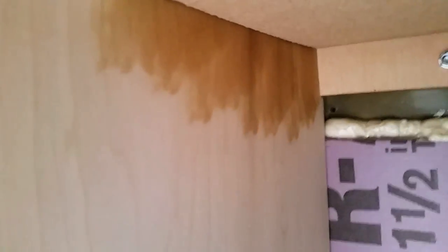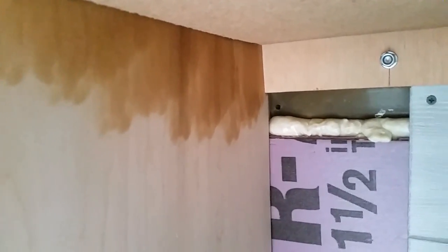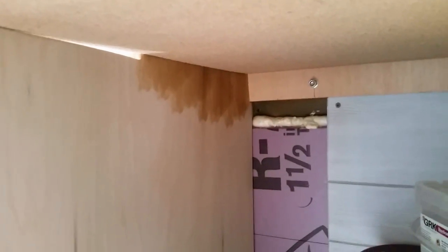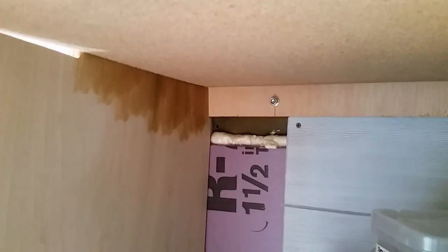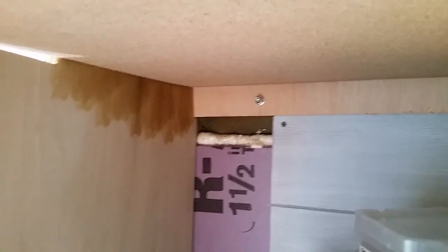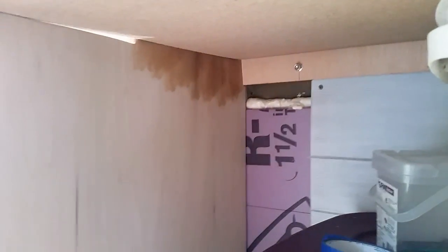What was so fiddly is that I have to have a board underneath that is bolted to the L-track. When I put everything together, that board will be bolted into the back of this cabinet wall on both sides, and that's what will hold the whole cabinet to the wall. I put three bolts in this L-track — one in the middle. I don't expect the L-track to give way; I'm more afraid the screws in the back of the cabinet will give way. But that board is five inches wide, so I've got room for three or four screws into the back of each cabinet wall.